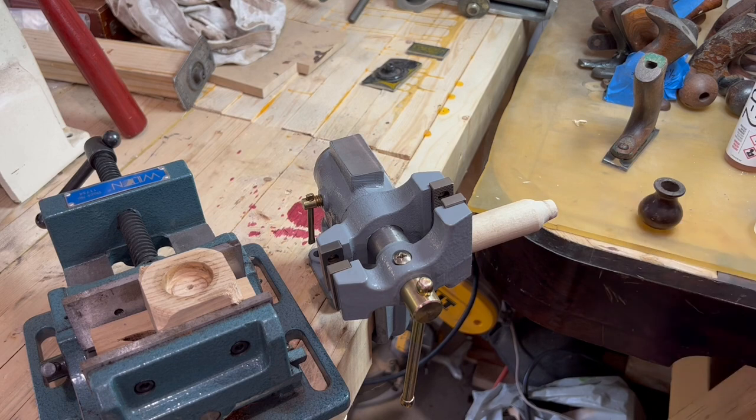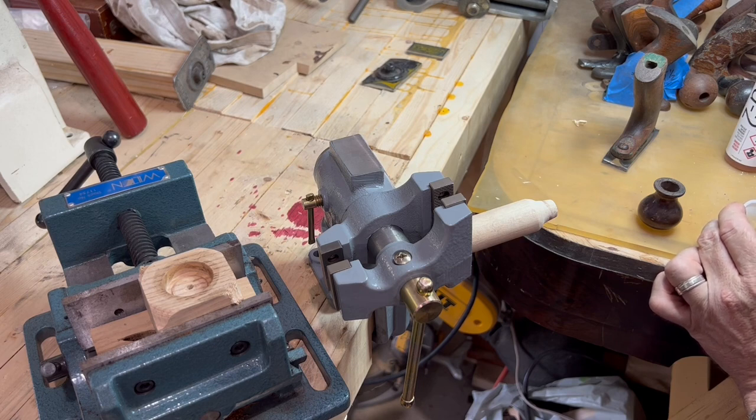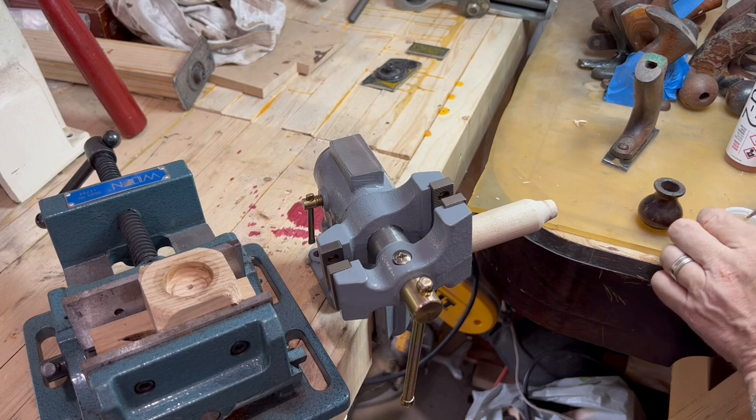So here's the G2 — it's a two-to-one ratio, two parts resin to one part hardener. You've heard me say this before: more hardener is not more better. It's not going to make it stronger or make it set faster — it's actually going to cause problems. So stay with your manufacturer's recommendations. One part is clear, one has a slight tint to it, which assures me that I get a good mix. I'm well blended. I don't put any tint or color in until after I've mixed my epoxy.